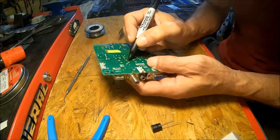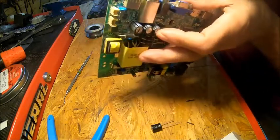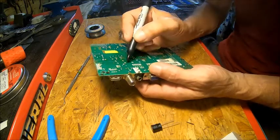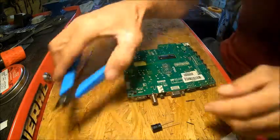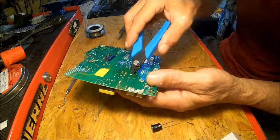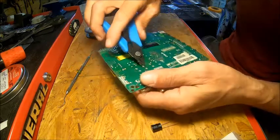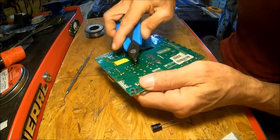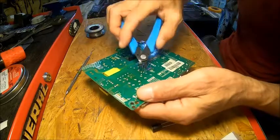So we will start looking for that — that is this one, this one, and we're going to go with the third and fourth. So these two need to be taken out. A lot of times they have a lot of pins sticking out. Basically what I'll do is go in here and clip those pins as short as I can get them, because they bend them over. Sometimes they don't cooperate with you, but we want them to be as short as possible.